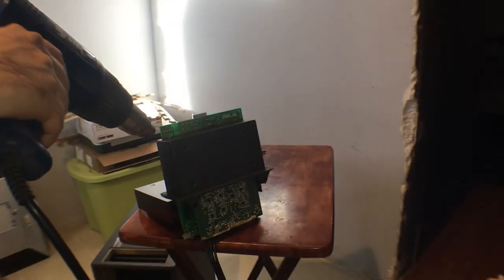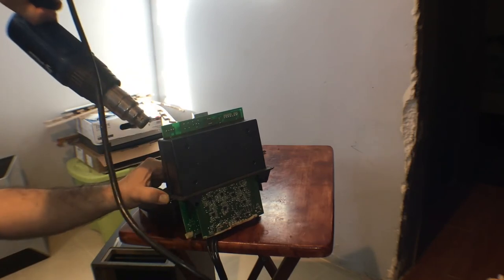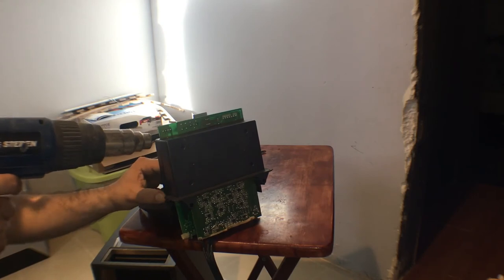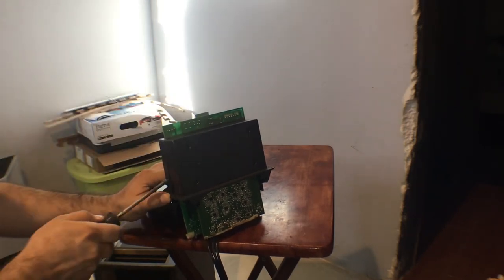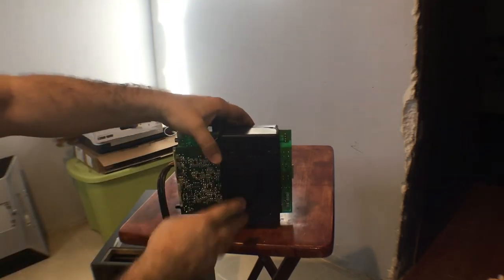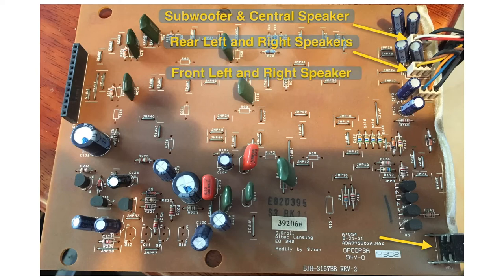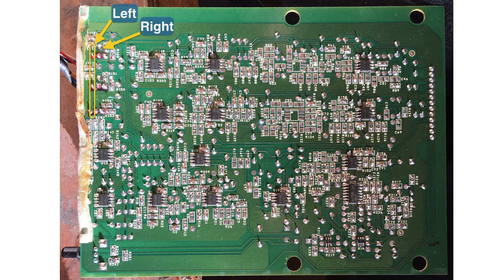To open the subwoofer box, you have to warm it to weaken the glue, but it was still very difficult to open. The top plate is the preamplifier board — it contains the bass level adjustment and the inputs for all channels, and a connector sends everything to the amplifier. At the bottom there is only a series of electronic switches and operational amplifiers. I could not find a single digital circuit, so I do not know how it detects or processes a digital input.